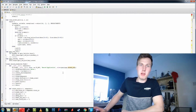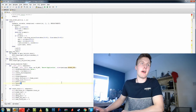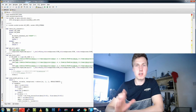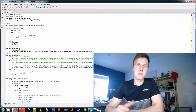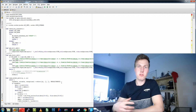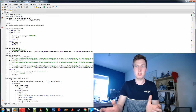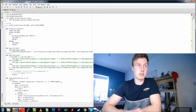It's written in a language called Python — WXPython to be specific — and this is what runs on the Raspberry Pi. This controls everything. It gets corrected coordinates from a free program called RTK Lib, which I did not write. RTK Lib is written by a Japanese developer, and it takes the raw information from my GPS in the tractor and combines it with base station corrections coming from the farm over the internet, giving back really accurate coordinates.